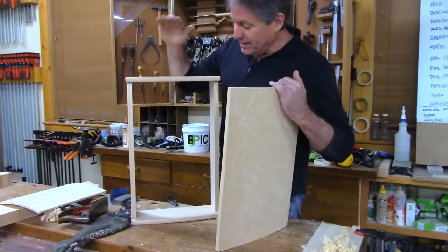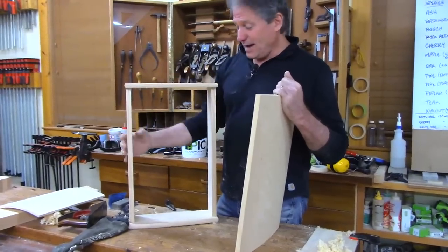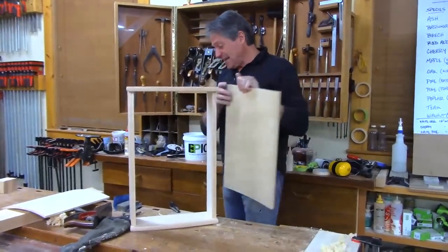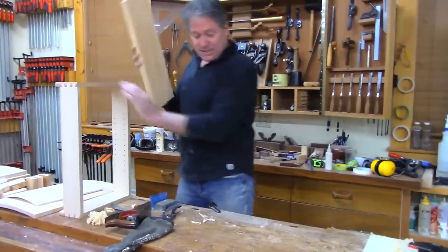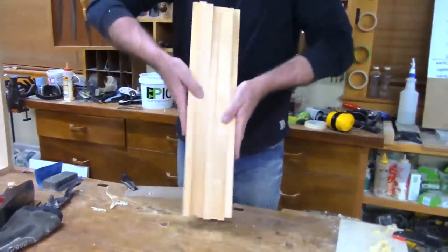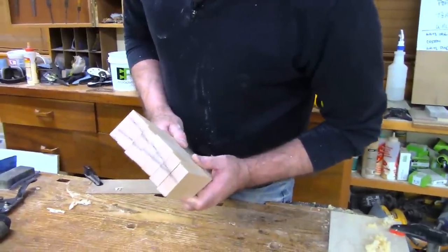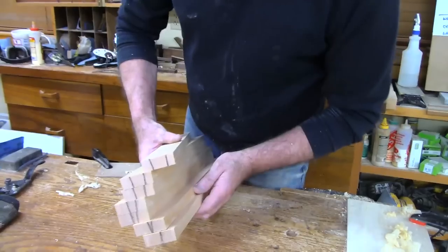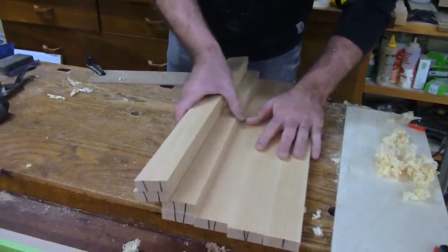It's a laminated door. But I thought, wouldn't it be great if you could make more of a utilitarian cabinet out of all white pine, so you ended up having quarter sawn. This is all ash. And then made your door solid in that same way. Well, here's how you would. I cut some other staves while I was at it today, because I was thinking about this project. And this one shows you more how I like to keep them in order. So if I was making a larger door, I make that arrow on the end of the board before I rip it into strips. Okay, so I've got those. And then I already cut all the bevel. So then when I put them down, I'm going to lay them sequentially in the same order. So it's basically a slip match every joint.